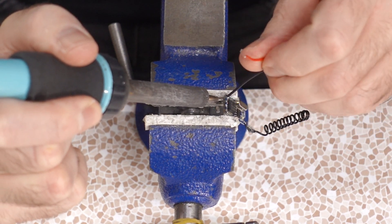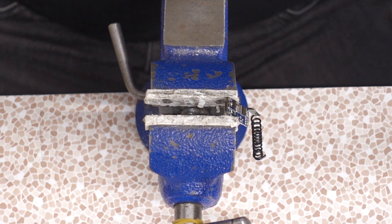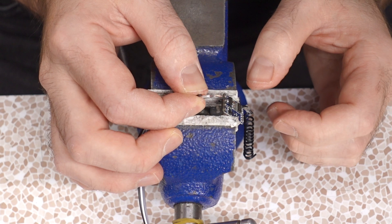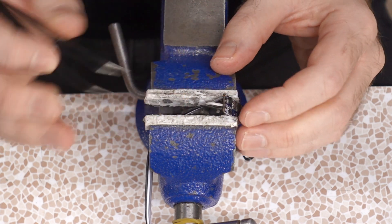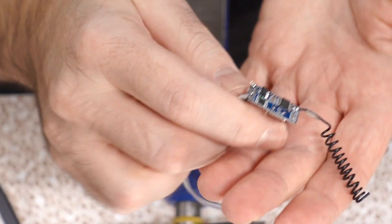Now it's just a case of wiring up. Got the old heat iron ready to go. I've got to pull out these old wires from how it was implemented before, and clean out these holes. Can't quite get the right angle here — need to flip it around. So we got our wiring harness: V negative, V positive. The gray is the signal — that's going to go to P negative on this unit. White is positive — there's V plus. Black is negative — V minus. Now to the best of my knowledge you can pretty much pull ground from anywhere. There might be some impedance on that connection — they might have something like a 100-ohm resistor on there. You just need a little bit of ground signal. When it comes to logic level, it's so low in the microamps that even a pretty high impedance resistor like 1k is going to be completely transparent. So that should be ready to go now.